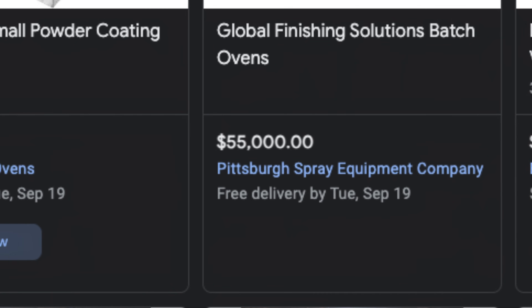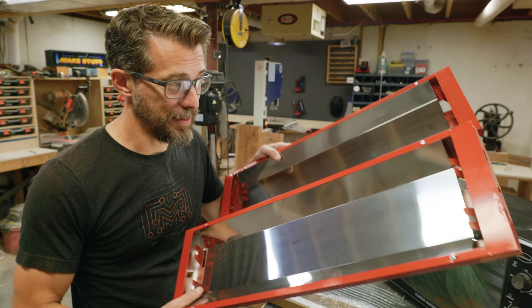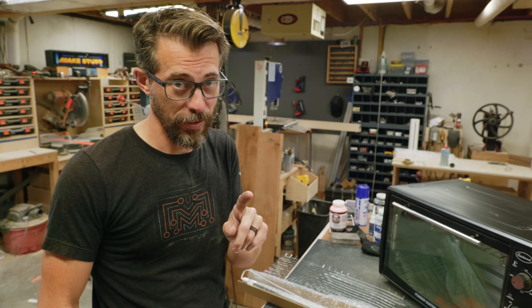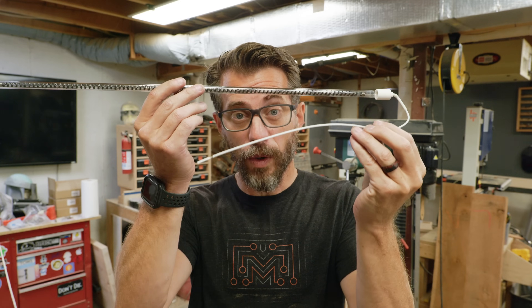After seeing the prices of those big ovens, I started looking at some infrared heaters on stands that you can roll up to an object and bake it kind of in space, but those are anywhere from three to six hundred dollars minimum and I don't think they should be. That led me to find these. This is a set of two infrared heaters that together will produce 2,000 watts at 400 degrees Fahrenheit, which is the perfect temperature for powder coating, and the two of them together were $55. The only downside is that these tubes are not pre-wired, so I have to wire them up and be really careful not to break the glass.